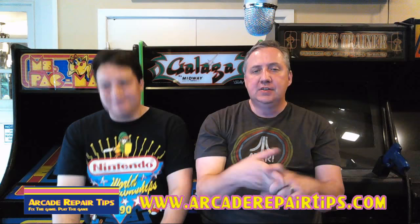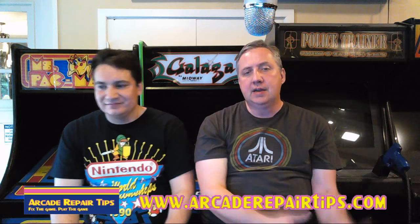What am I trying to say? A Cherry Master. You know, one of those boards with touchscreen boards like that. A lot of those are JAMMA, and you're just using it to see if it's a picture. So if you plugged in, let's say, the Cherry Master board and it looks fine, bam, you know it's a board issue. Exactly. That's a great thing to have around, an extra JAMMA board of some sort, because a lot of games are JAMMA and it's a good way to test.